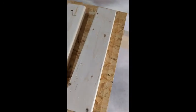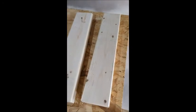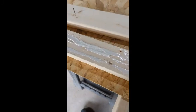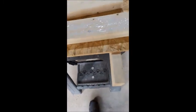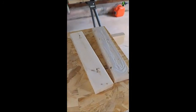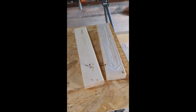I started two nails on one side — this is going to be the side I lay the glue on. They didn't have the glue I wanted, so I'm just using Gorilla Glue. It is rated for outdoor use, but it's not my favorite. I get a pretty good amount on there and spread it with a paper towel. A paint roller actually spreads it smoothest, but I don't have one out here. Once I nail it together she'll be tight. Before I nail it, I've got to line the boards up, clamp it, then nail it with clamps on — then I can reuse the clamps on the next three.